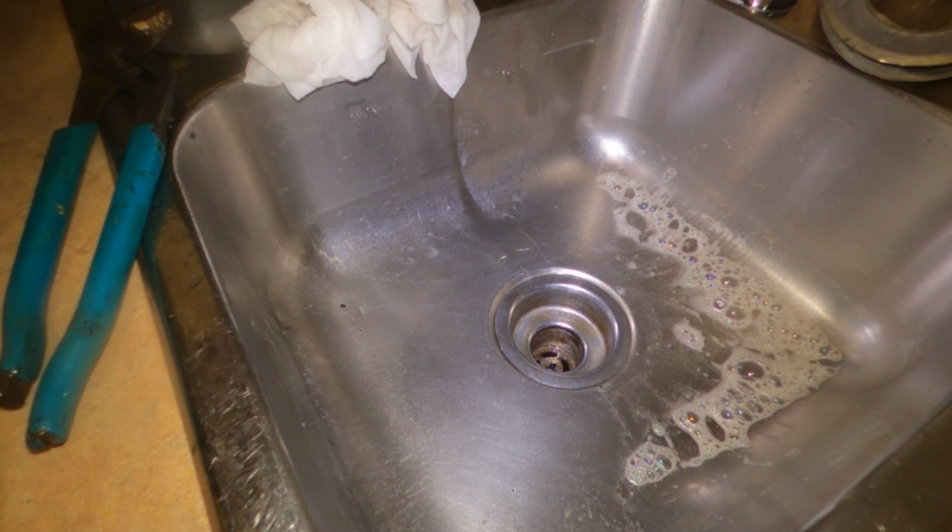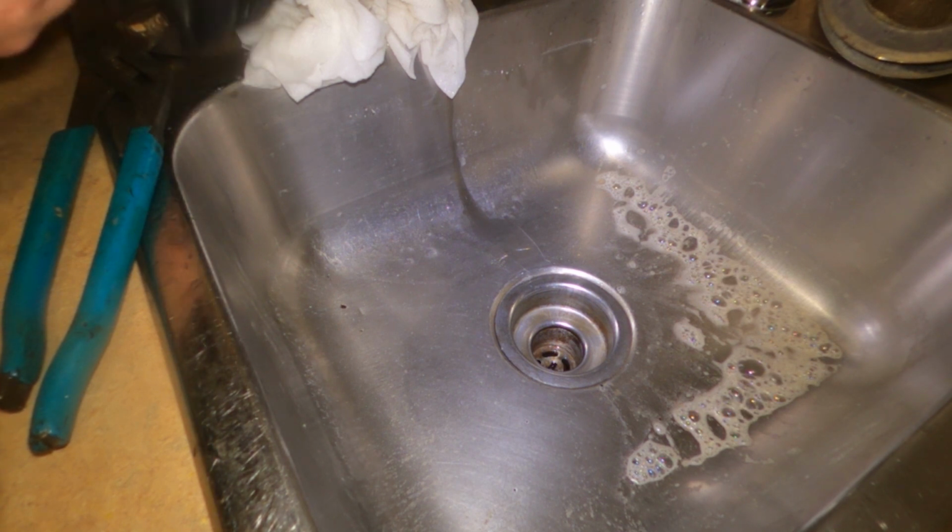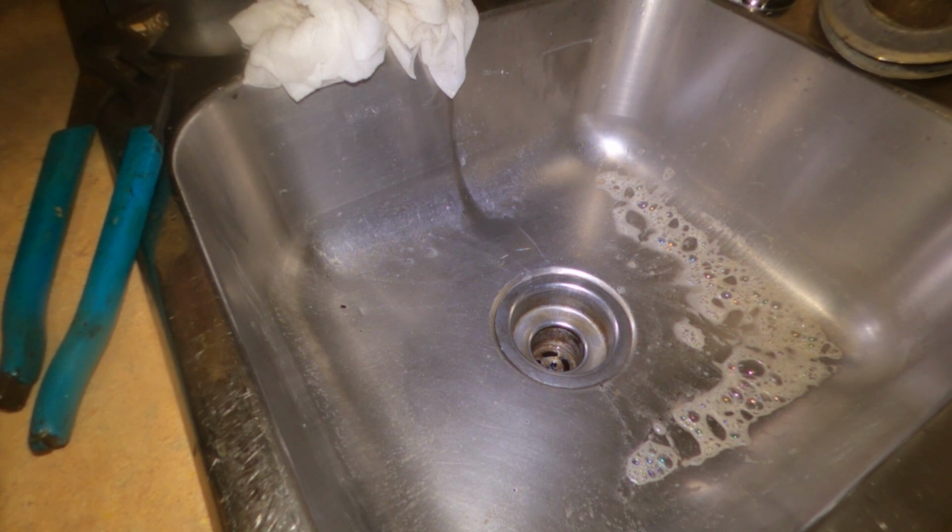This one might be tricky to get out. Just go like that. But don't they carry a strainer as well? You don't want a strainer in these, because there's a filter already on the line. When you start reducing the water pressure in apartments, you're not getting enough volume and hot water to push everything down and melt the grease down.